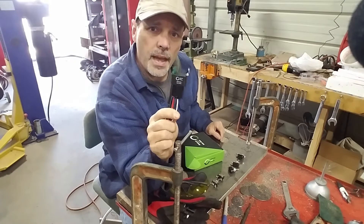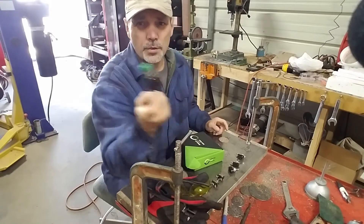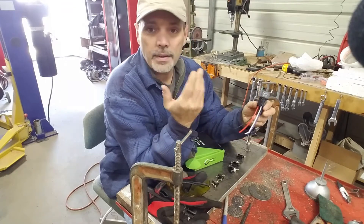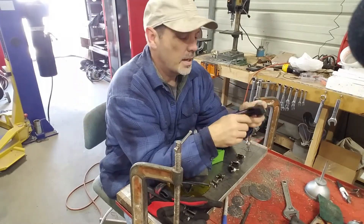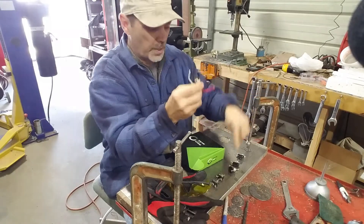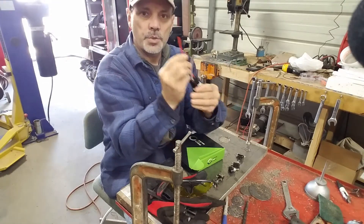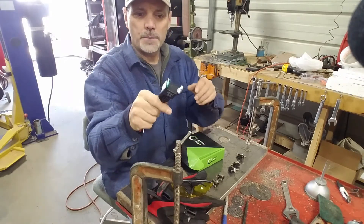These are relays and they have a built-in fuse — that's really cool. We're basically building a temporary car, and there's no reason to create problems if I don't use a relay. I don't want anything sparking and electrocuting me while I'm on the board here. You've got a relay with two little wires that run to my switch. I'm going to be disconnecting and connecting this ground wire, which creates a magnetic pull, which creates a switch in here, which runs electricity straight through to the motor. That's where my little fuse is going to come into play on the red wire.